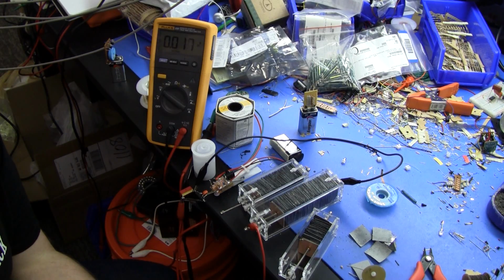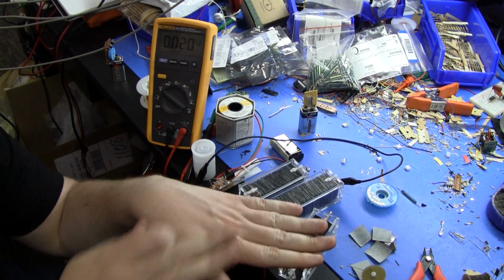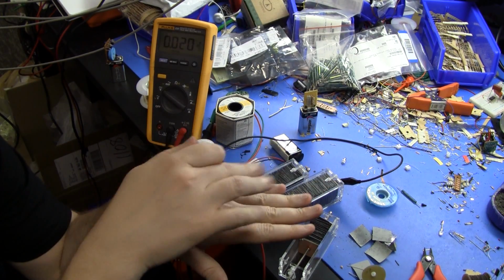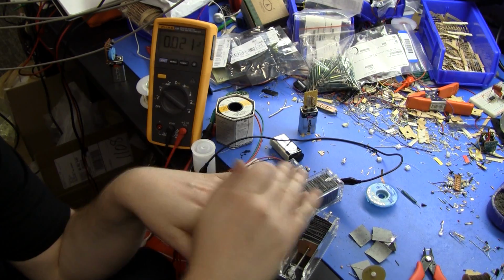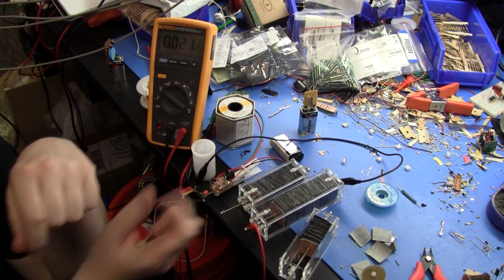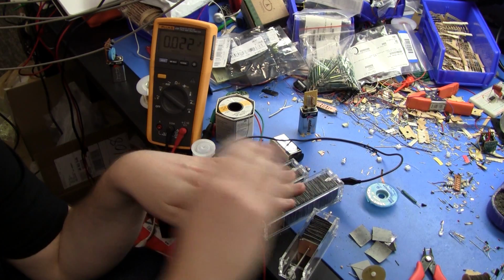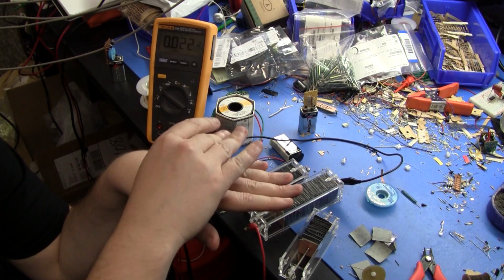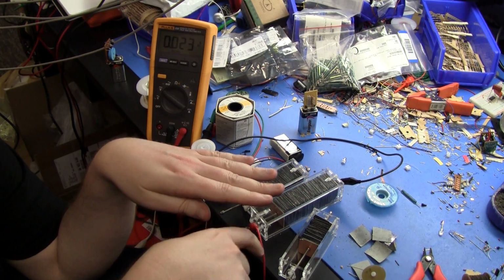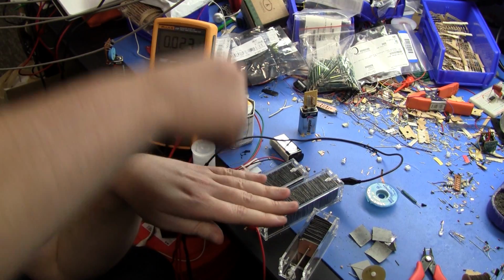It's kind of the reverse of those electrometers that they had back in the 1800s. So the first electrometers that could actually measure the output of voltaic piles. They were called a condensing electrometer. So you had one plate on top of the other with a thin piece of dielectric. Normally had little glass standoffs, or they'd coat one, the plate that was attached to the leaves, the leaves that move apart when they're charged. They'd have that insulated, so they'd charge up the top plate, and then by grounding the bottom plate by induction, they'd charge the part with the leaves, and then you'd pull off the other plate.